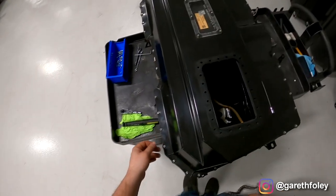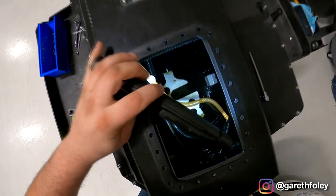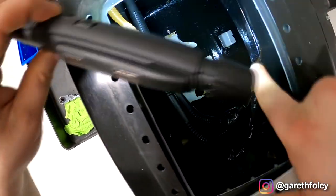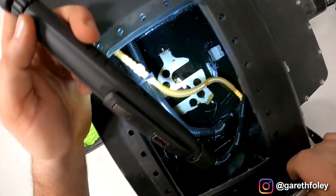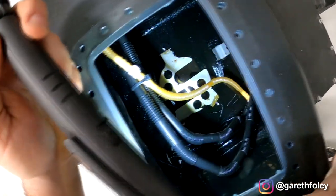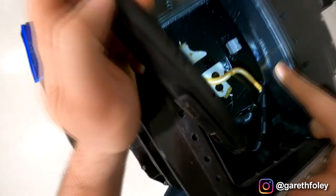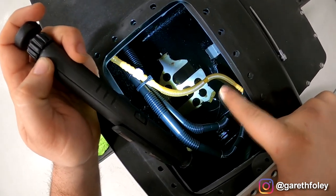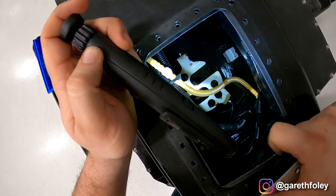Here's the other access plate. Looking down inside the fuel cell, you can see some of the foam right over there in the corner — pieces sitting there. What I'm going to do is agitate the inside of this bladder once I have it apart, remove all of the venturi pumps, get all the stuff out of here, use the fuel to agitate everything, drain all the fuel out, and then try to blow it all out with compressed air once the fuel cell is dry.